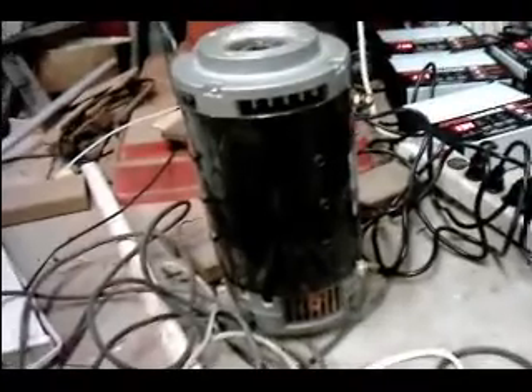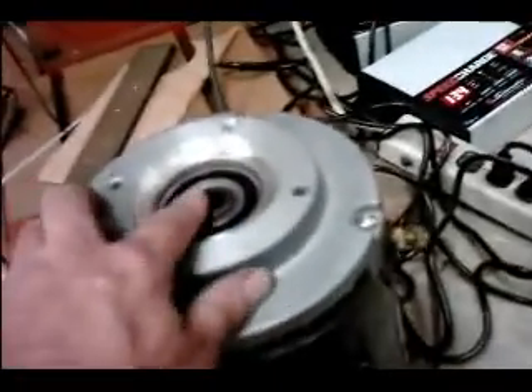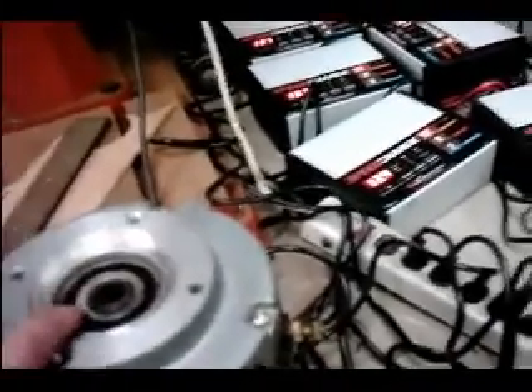Anyway, this is my motor. I got this off eBay. It's a 6.7 inch Clark forklift motor — brand new, 8 brush, weighs about 93 pounds. It's got a funky shaft. What I'm going to do is pull it apart, pull this housing off, and maybe machine it for a bigger bearing. Then I'll press a plug over it, key it, and use a double bearing — put another bearing in here too to support it, because I might have a flywheel on there. I'm not sure yet.